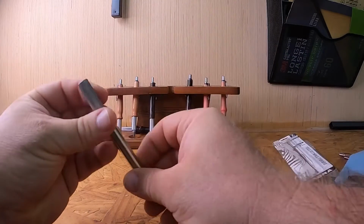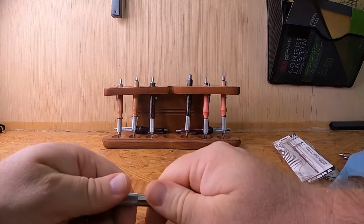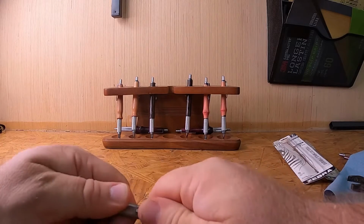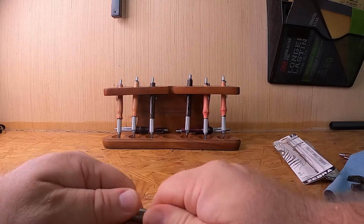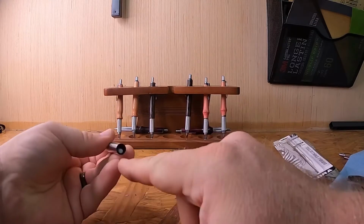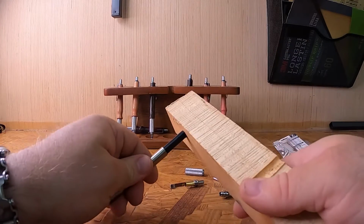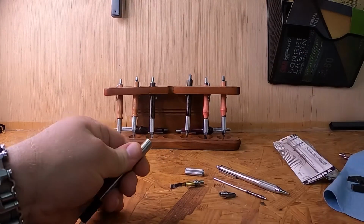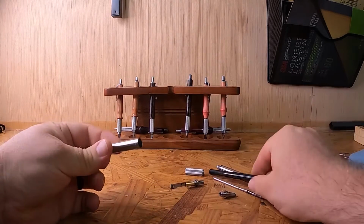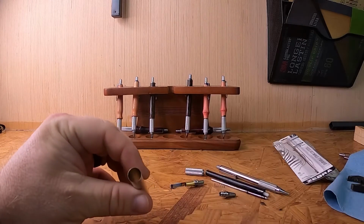Remove the upper pin. Now you can wiggle it back and forth a little bit, and you can see that gap forming there. So this knurling section will actually come off. You'll end up with the black tubing that goes all the way through, and that's removed with a little mechanical agitation. As you pull it free, now you're left with a tube for a pen blank.